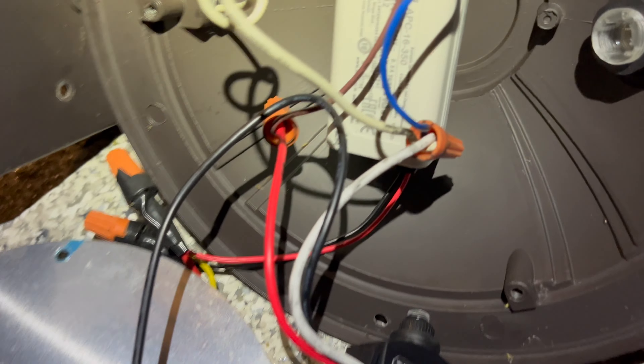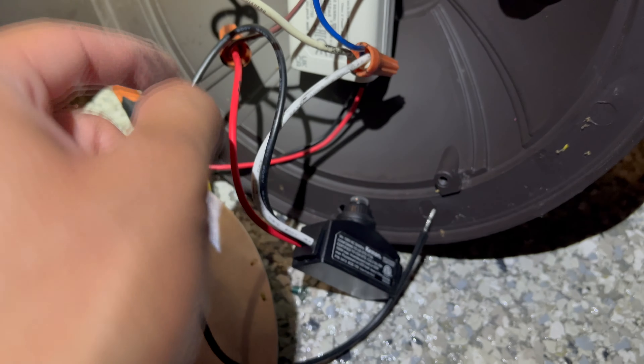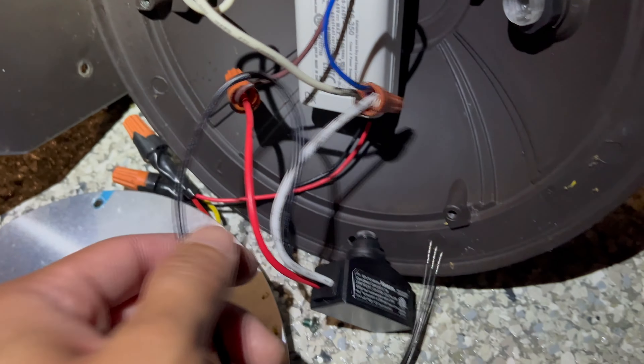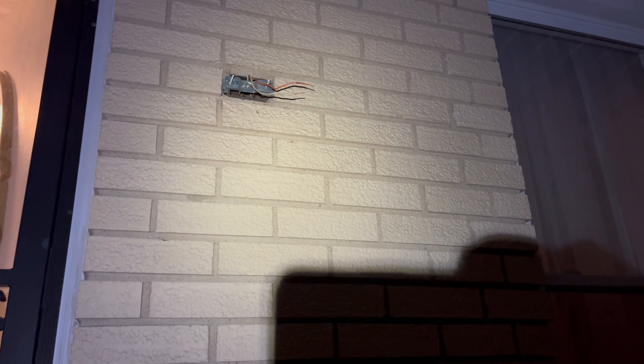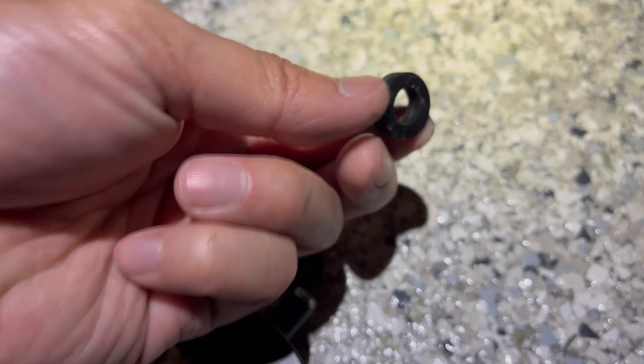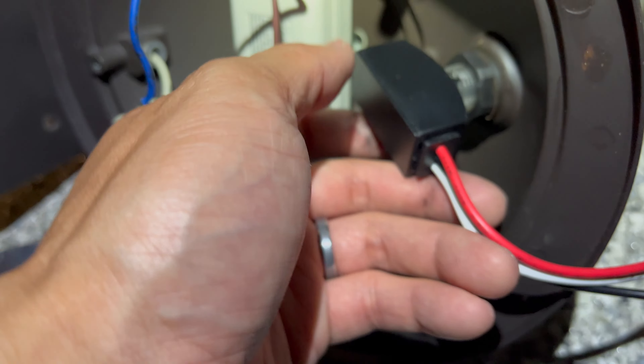Just make sure that the white and blue go in the same connector, and the black and brown go in the same one too. Then this black wire goes through to the other side and hooks up with the white wire back there, connecting to those two wires. So basically it's white to white and black to brown in this case for this house. This one had a couple of rubber washers and a little screw on it — some require that, but this one just requires spinning it to twist it on — and then we'll rewire the rest.